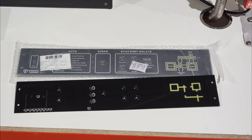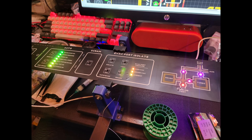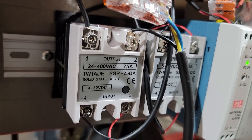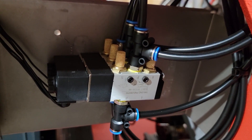I went ahead and ordered the boards from JLCPCB, and they got to me in about a week. The first thing I did was make sure all of my measurements were correct and that they were actually going to fit into the 19-inch equipment rack. Then I soldered all the parts in place — I hand-soldered all of these APA102s, added the mechanical key switches, and these little square keycaps that I think gives the whole controller a very industrial vibe that I'm really into. Then I had to wire everything into the controller, including both of the pump relays as well as the pneumatic relays which control all of the high vacuum valves.